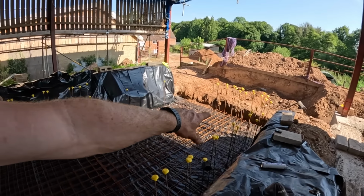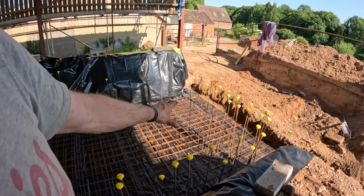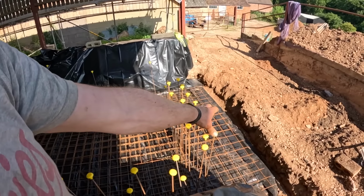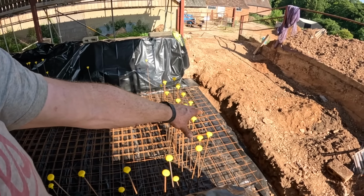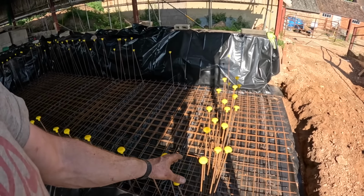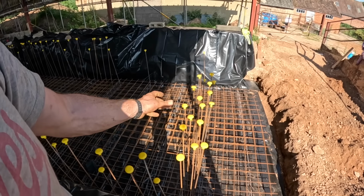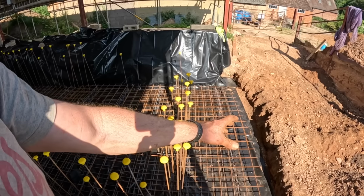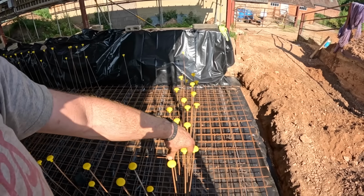Tom started that end, so he's got to this end, basically ends up with a swimming pool this side and a void this side, because there's going to be an access void underneath the floor level there, and then plant room outside as well. So rather than hide all the fittings and pipes with no access, we're going to keep that as a sort of crawl space almost, so you can come through the outside wall into that void and access bits on the back side of the pool.